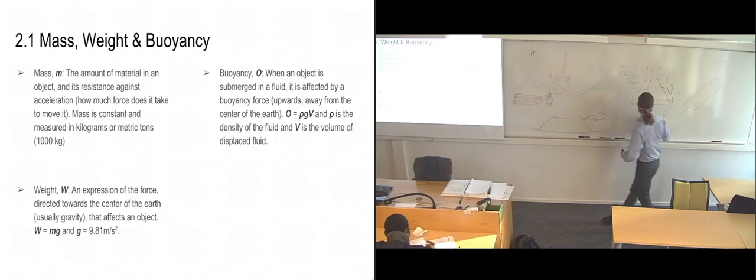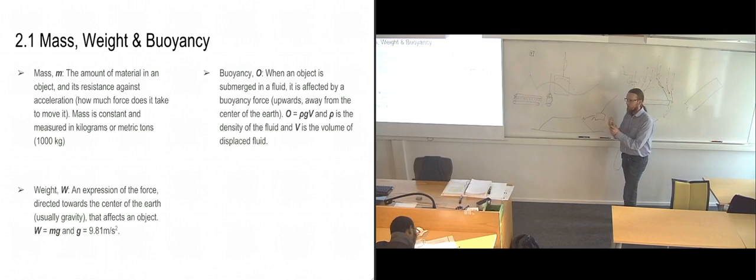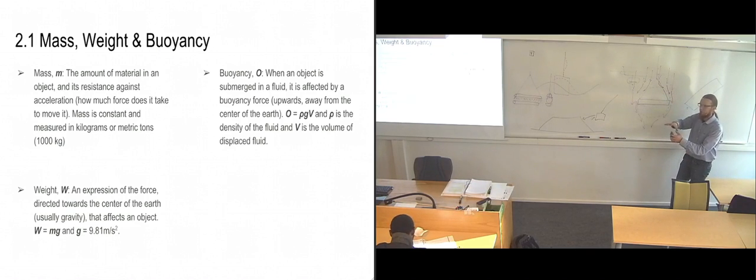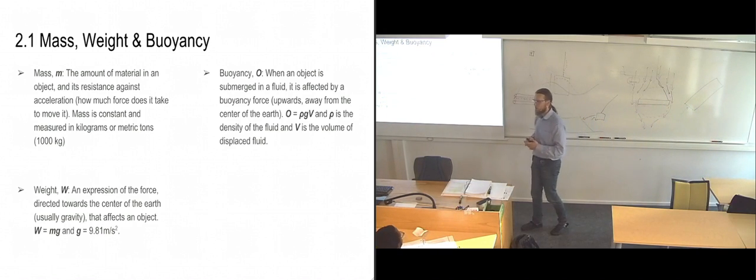But one thing is, if you're doing this huge plate where you don't have that much weight in the plate itself, and you have much more added mass to look at, then you can actually get to the point where the resistance to start acceleration is going to completely go past almost the lowest speed setting on your winch. So even though you're just barely touching the forward lever on your winch to start lowering it down, this one could stay still for a little while before it starts sinking. So that you basically get a slack almost no matter what you try.